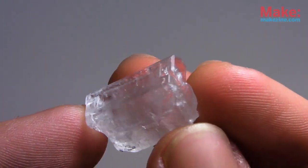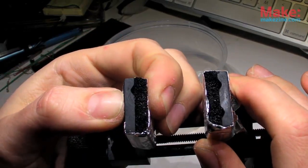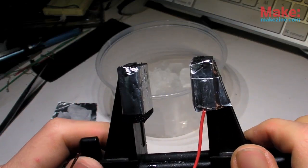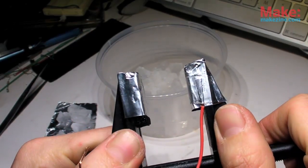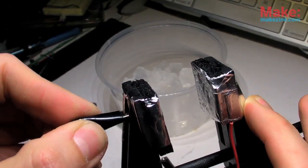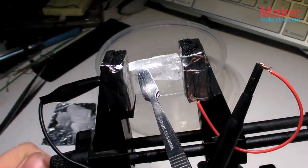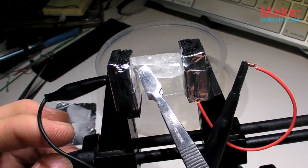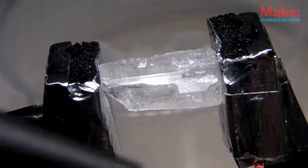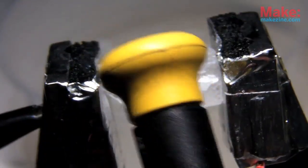This one looks pretty good. I added a bit of foam padding and foil tape to my Panavise jaws, so the crystal can be held somewhat gently while providing an electrical contact to each side. Just need to hook up my oscilloscope probe, mount the test crystal in place, and I'll use the handle of a small screwdriver to apply mechanical pressure.